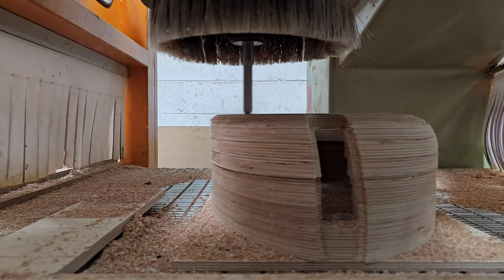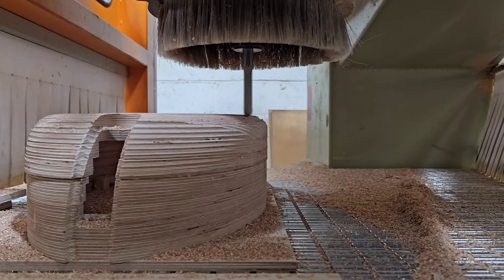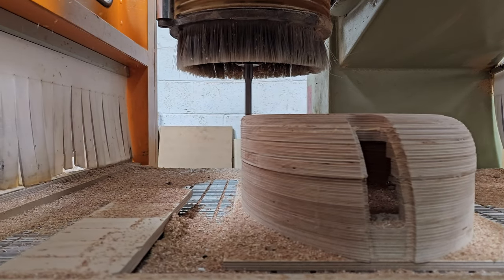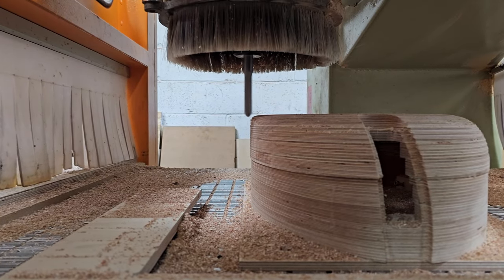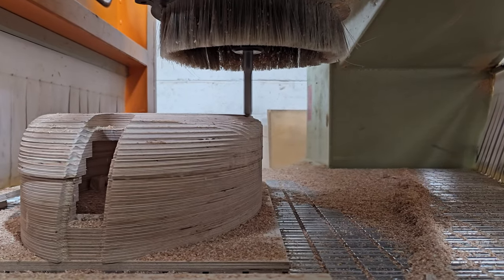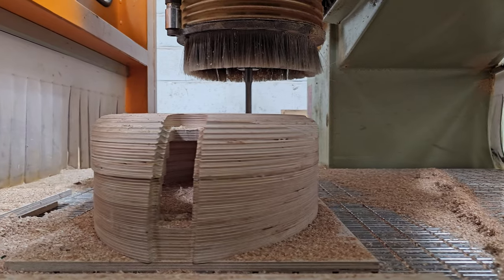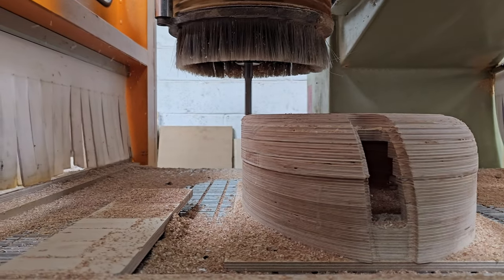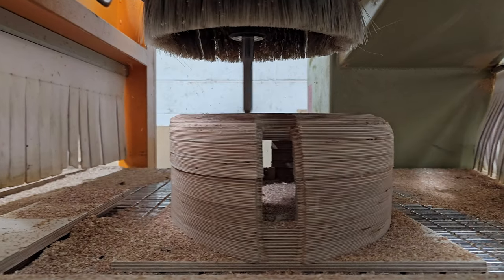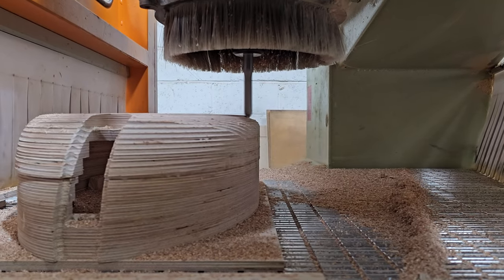So same again, for love nor money, I could not persuade it to cut around the periphery of the baffle cutout that we just watched, that 8mm and 12mm forming in there that we can't quite see, but we know it's in there really. So I'm employing another constant cutter engagement toolpath that just doesn't seem to keep the cutter constantly engaged. I was not really sure what was going on here. It's meant to keep it at depth.